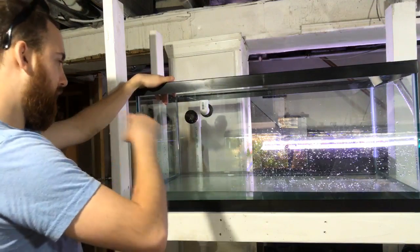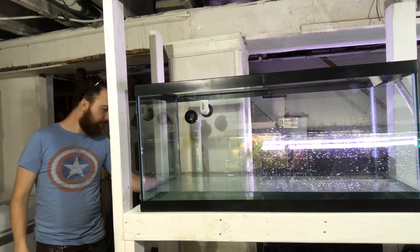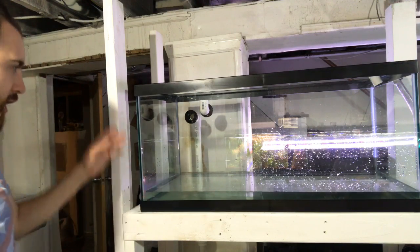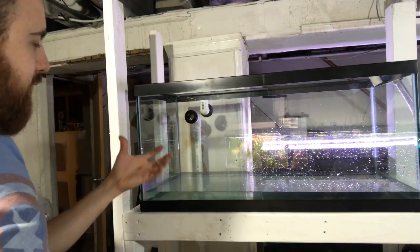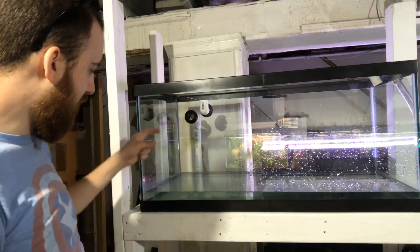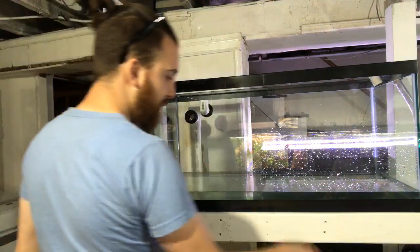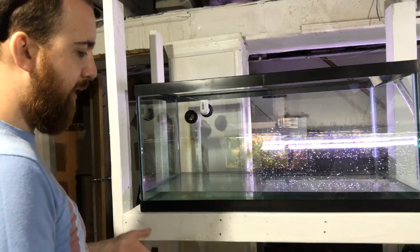it'll automatically turn on. And what's going to happen is it's going to close the valve here. There's going to be an electronic solenoid on each overflow pipe, or at least the regular overflow pipe, so it'll electronically close, and it'll allow the water to stop draining into the bottom tank and into the main drain that's going to be there. And so the pumps are going to shut off, because all the pumps will be on the timer opposite to when the water change is happening.